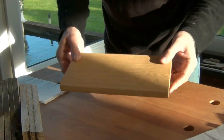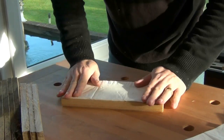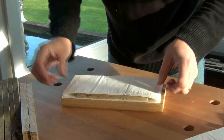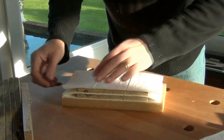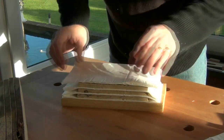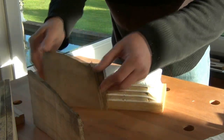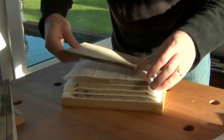I'm starting out with a nice flat piece of oak that'll be the base for the clamping system, and I want to layer the absorbent towel with the slices of jarrah as they came out of the log. I've got two different sets — one's going to be for the sides of the box and the other set for the lid and the base. I'll probably bookmatch the lid and the base and hopefully wrap the match around the box. It should clamp together nicely and I got a reasonable finish from my homemade bandsaw.